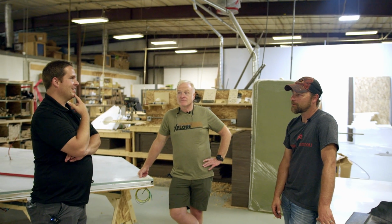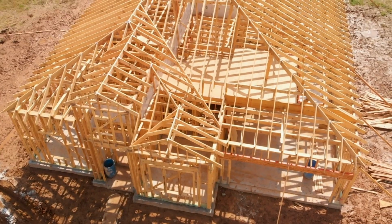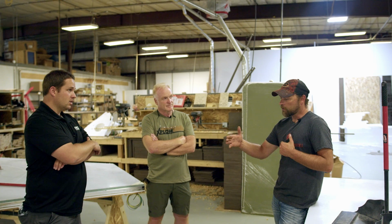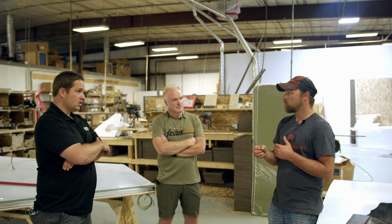And that's not how they do it in Utah. No, that's most places of the country, not just this region. We do 2x4s, and then we put the batt insulation in and just staple it. Well, there's some science behind that, where a steel stud building or house or a trailer, aluminum stud, depending on the spacing of the stud and the thickness and dimension of the stud, your insulation value between the studs can be brought to 0. So it's almost as if you didn't put any insulation in.